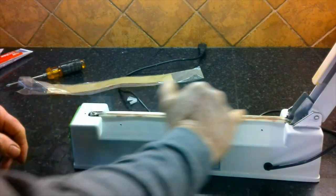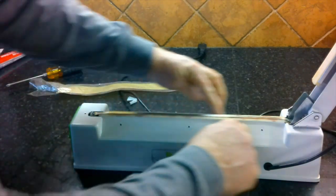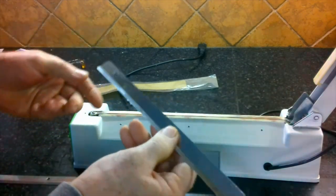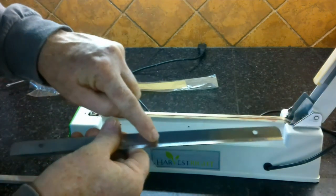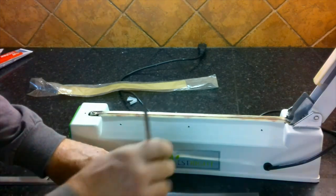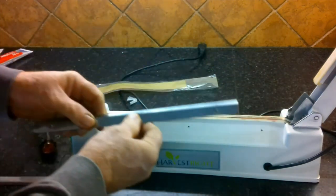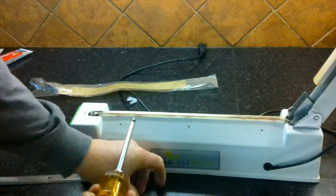We have the lower pad in place and the element on top. Next we need to put in the side supports — the side clamps — before installing the Teflon cloth. One note about these side supports: if you over-tighten the screws, it can flare out the inner hole so it doesn't lay flat. If that happens, just flip it over and with a screwdriver used as a hammer, tap lightly to smooth the flared end back flat. Put the side supports back into place but leave the screws nice and loose to start.